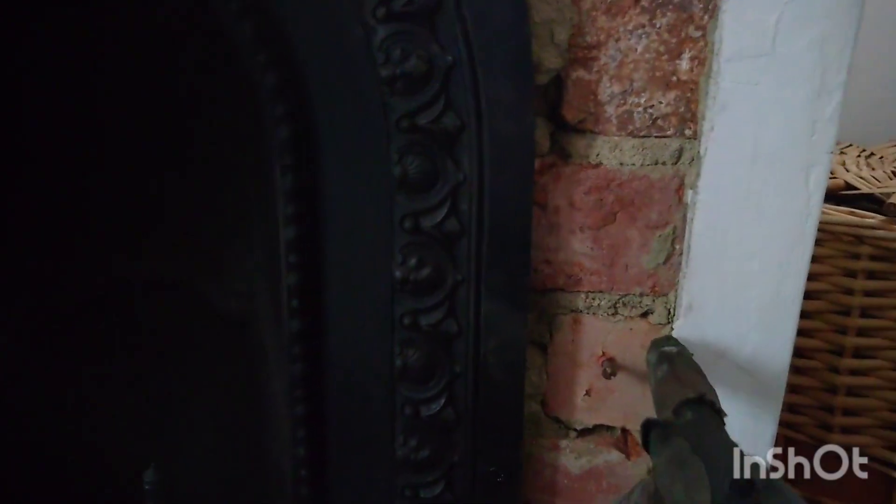Once it's always a good idea to leave a bit of a gap at the back when screwing it into position. These surrounds are really designed to just sit with space around them. What I've done is made the gap the same width and depth as the plaster, so when the plasterer goes behind it, it'll give a bond as well. It'll give a really nice finish all the way around — it should look like it's been there for years. These properties are 1930s. You can see I can get my finger behind there.